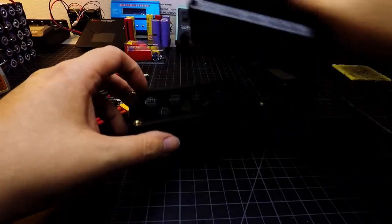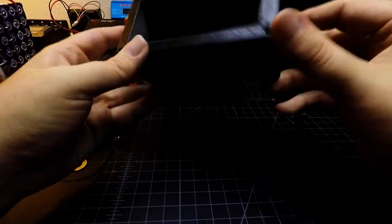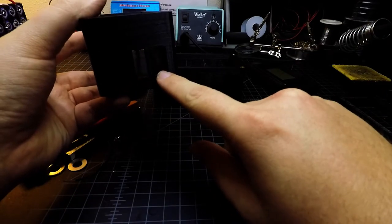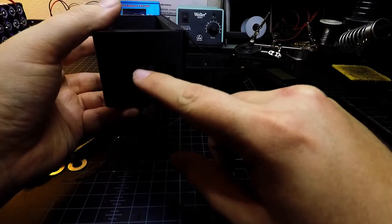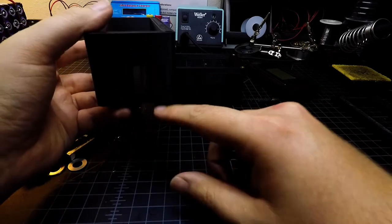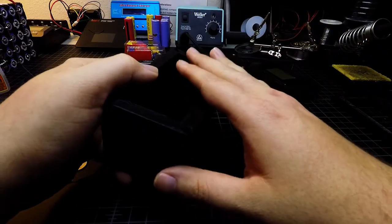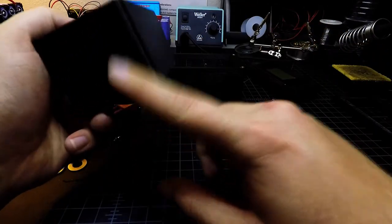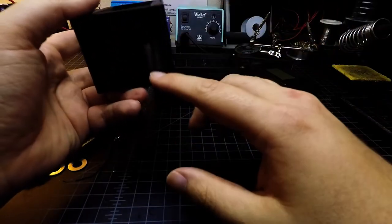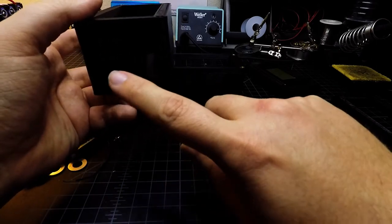This was the first print of the lower section. I'm intending to use two XT90 connectors because this is also going to work for the 2,000-watt system, so I wanted to build the internals of this watt meter to handle the 100 amps of current that system could pull — actually it's more like 90, but I built it for 100 just to round up.